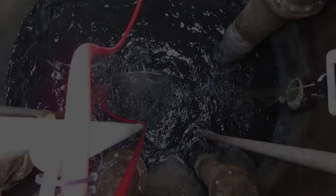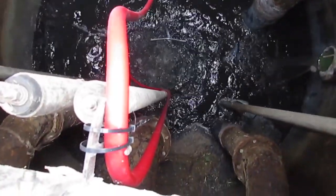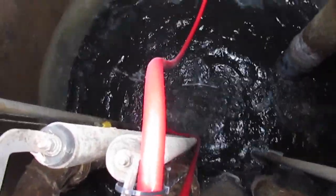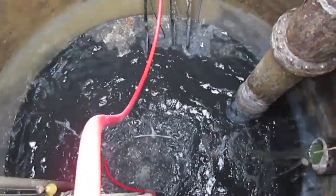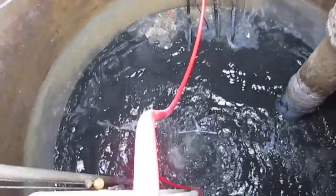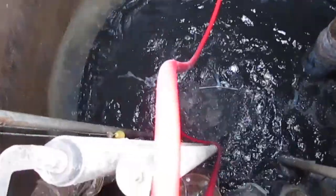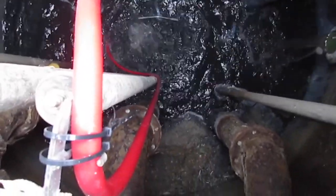20 hours after the wizard installation, the fog cap is completely gone, but there are still some minor pieces of grease that have been trapped behind pipes and other vertical structures. Notice how black the water is. It is totally anaerobic. Over time, as the dissolved oxygen rises in the water, it will become more clear and all odors are eliminated, unless they are coming from lift stations upstream.